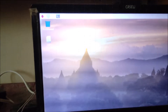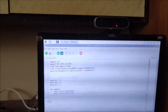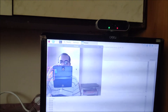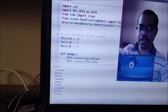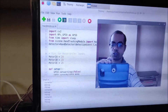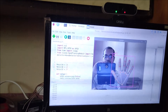This is our Raspbian Buster legacy version. If I start the Thonny Python editor, you can see the script. When I start the code, it starts the USB webcamera. The camera is started and it's already tracked my hands, so the motor has started. If I move out of frame, the shell shows 'no hands' and 'B stop' and 'F stop', which means the motor is stopped.